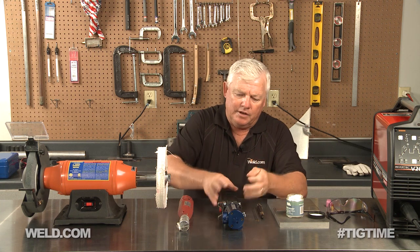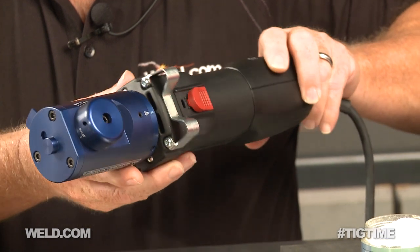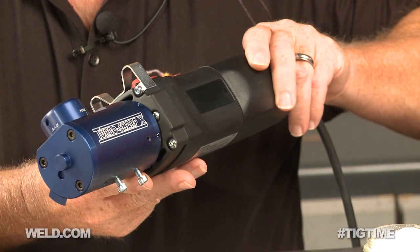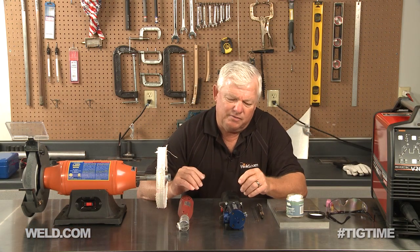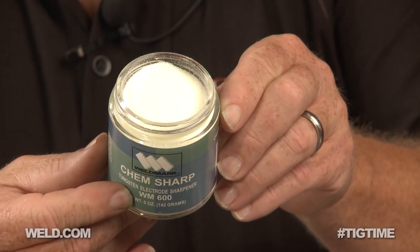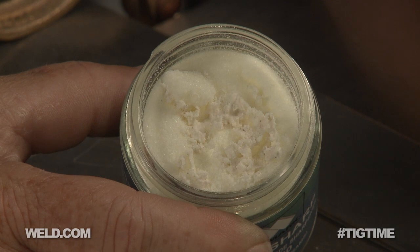I'm going to move over here — this is my heavy-duty version. This one is much more power and I use it for more industrial use. I can get probably 3,000 grinds out of this before I have to change the wheel, and the wheels are arguably $50 or so, so it's not a huge investment. Now, this little bottle right here is under $10, and I have a love-hate relationship with it. The love-hate relationship is that when you don't have grinders with you in the field and you need to put a point into your tungsten, this becomes your best friend.